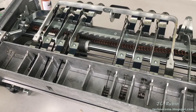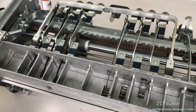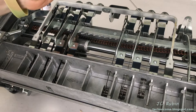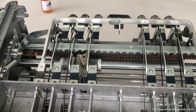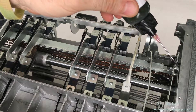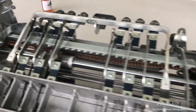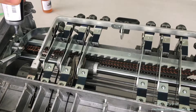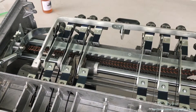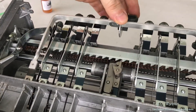Now we turn the machine over in this position and oil the linkage pins — 1 through 12. Now I'll add oil to each trunnion: one is over here, the other one is over here. Once I do that, I'll add grease to that one and then to this one. Moving the space bar up and down to evenly distribute the grease on both sides.